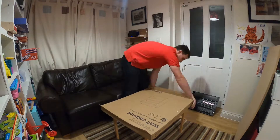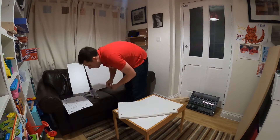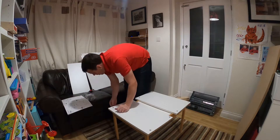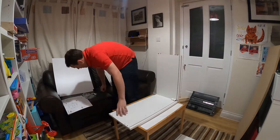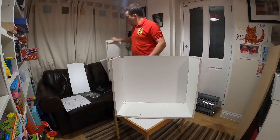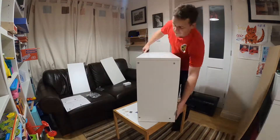I had a few options for this cabinet, so rather than starting from a simple plain sheet of plywood I've actually gone for a kitchen cabinet — a wall unit. It's made of 18mm strong board with a melamine finish, 18mm melamine on top of chipboard. It's a nice heavy unit, designed to take a lot of weight and abuse over many years, wall mountable with all the fixings within it — 600 wide, 720 tall and about 300 deep.